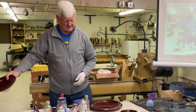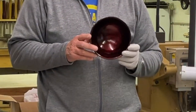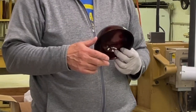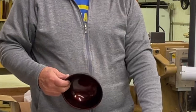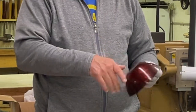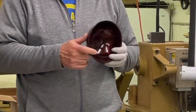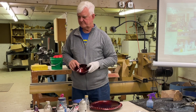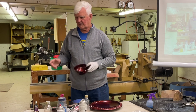Take a look at the black background on that. Check this one — same paint, same coloring, splattered over black, but not as heavy. That one's been sprayed first with this little red bottle. But this one, I do one side and then let it dry, then flip and spray the other side. It's much deeper — it looks like black cherry. You get splotching just from using that. There's no spray gun on that — there is rattle can lacquer over the top, and that's that one.